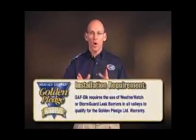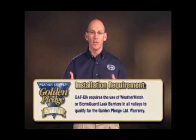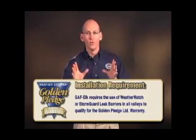That's why we require the use of WeatherWatch or StormGuard self-adhering leak barriers in all valleys to qualify for the Golden Pledge limited warranty. The woven valley is a highly waterproof valley because it leaves no exposed openings and because the two sides of the valley are usually blended together seamlessly.